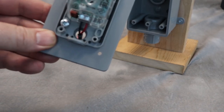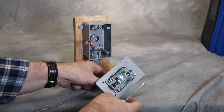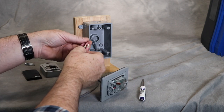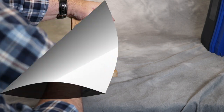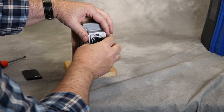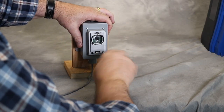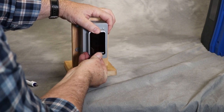At this point I'd probably throw a little silicone on there to close that hole up. I've pulled my wires into my junction box — I have one side of the connectors here and the other side of the connectors there. I'm just going to hook those up and screw the cover plate onto the junction box. The cover plate goes on this way and just snaps on.